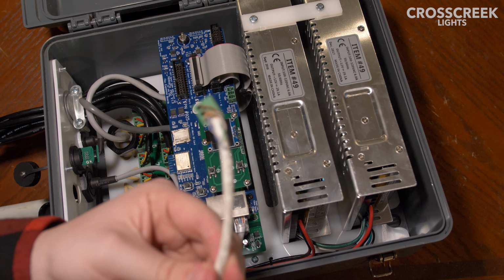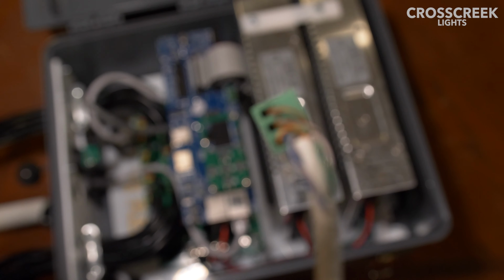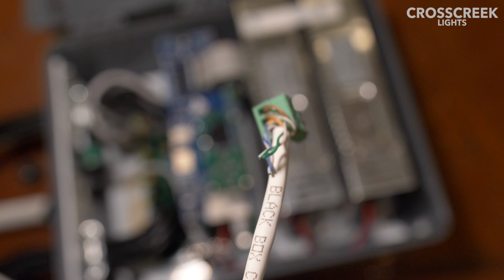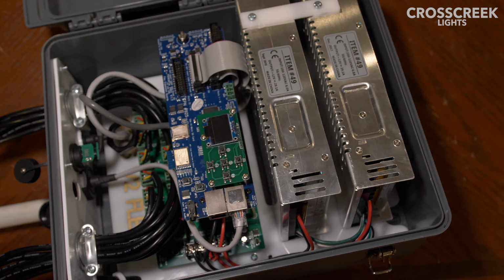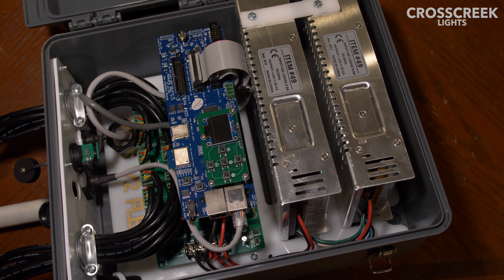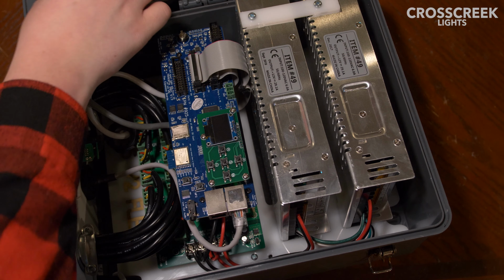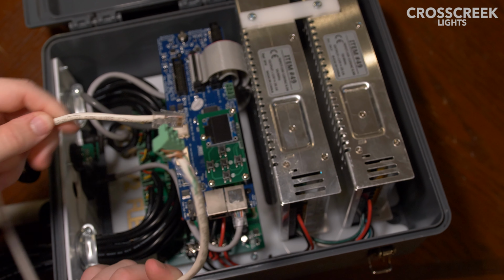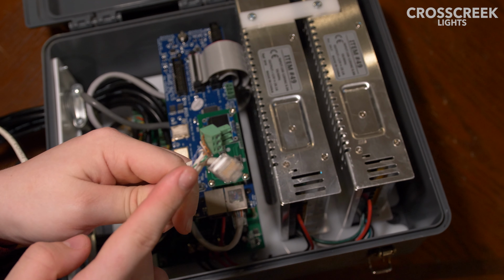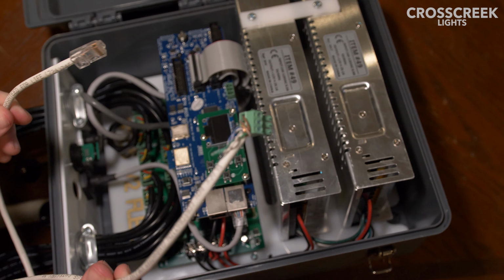So how I wired this, I'm not going to be able to get a good shot of it, but I wired it, here, let me go and bring it up closer to the camera here. So I wired it in a very specific way here. And I'm going to go ahead and put a diagram up on screen. I followed a tutorial from someone else that did this, so I'll leave links to their video in the description, but I'll put up their diagram on screen right now, and this is how I wired this for this. What this is, I have a little coupler here. All right, so this is just a normal Cat5e cable that I went ahead and terminated this end here, and then I did the specific pinout for each of these, according to the diagram that's on screen, like I said.